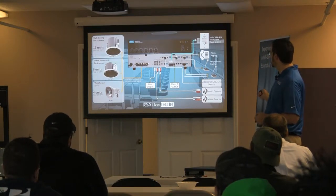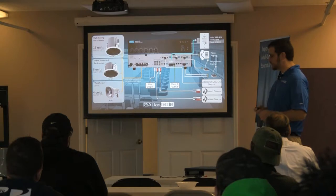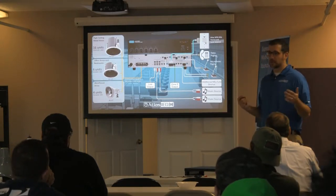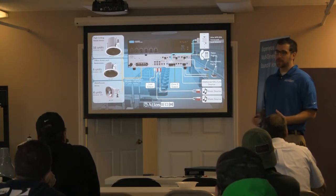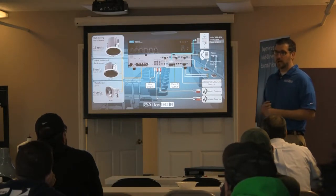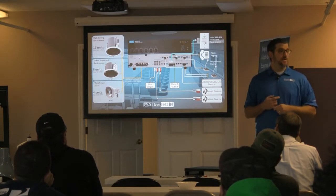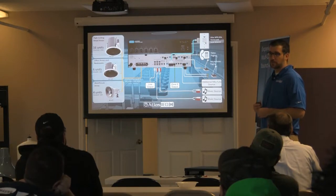Here I've got a 400-watt amplifier, same sources but now a couple of mics. I've got high-ceiling speakers which are my compression drivers. The restrooms are tapped at a lower wattage — 4 watts — and the main floor at 16 watts. I've got four speakers in my warehouse so the backup bagger can hear a page from up front. We've got multiple different types of speakers in the system, tapped at different wattages, doing different things. Another easy option — maybe background music downstairs for customers, paging in the warehouse, and sound reinforcement up here. One speaker wire running out to your speakers in one big line, and call it done.